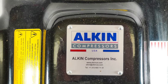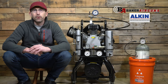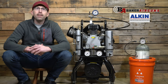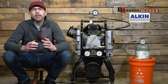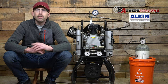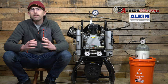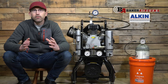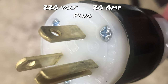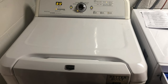Let's talk about what we need to do to get this compressor up and running. First and foremost, you're going to need a 220-volt outlet as well as a 20-amp or greater circuit to run the electrical motor. You're also going to need 24 inches, or 2 feet, around the entire sides of the unit to keep it cool and keep that air free of moisture. You're going to have to purchase a plug for the end of the power cord — this is a common practice in the high-end compressor market due to the many different plug shapes in 220-volt circuits. If you don't want to hire an electrician, you can use a dryer plug, because your electric dryer runs off 220-volt and has a 20-amp circuit.